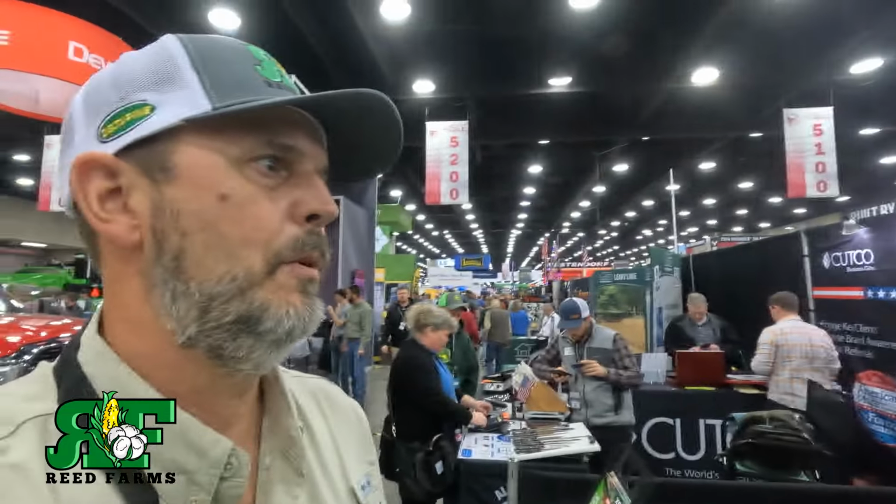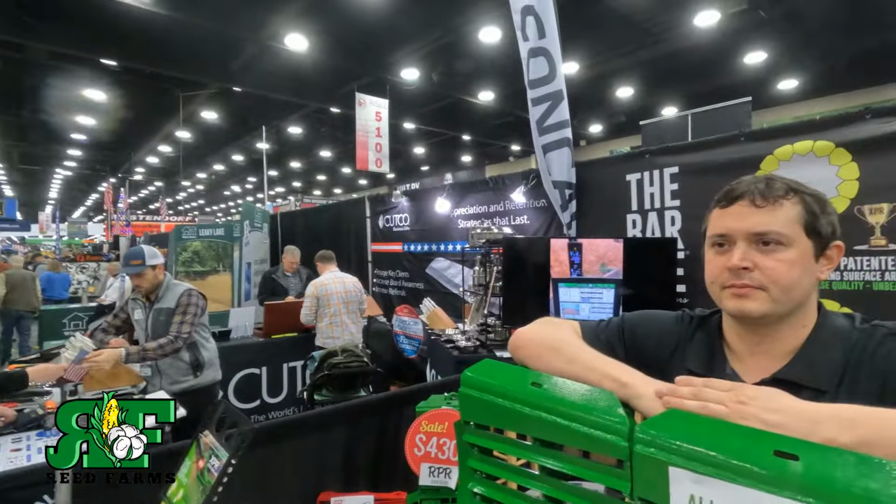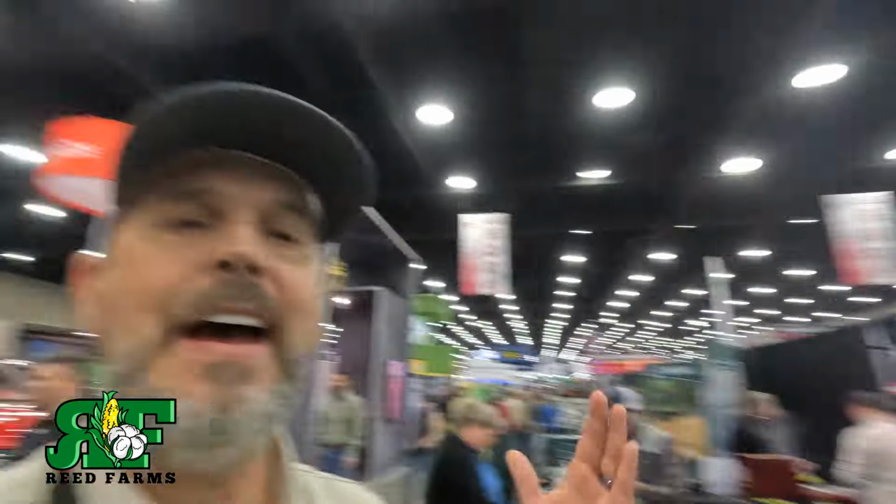Y'all saw me put the one more in there back in the fall, and that totally changed that combine. That one grate took that combine to Cadillac level. It was crazy how much that one grate changed that machine. And what were some of the issues that you were having? We were losing like 1 or 2% on the ground. But you gotta think, I have a 660. I don't have the capacity like a 670, so I have to get the grain in and get it separated in a shorter, smaller chamber than a 670.